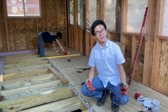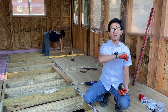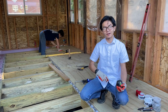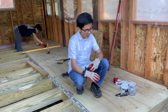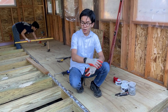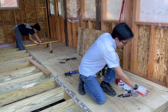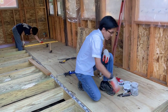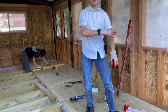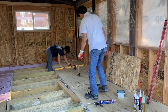Usually when you're installing things like furniture or something similar, you want to cover everything, all the corners, with screws. We're not going to do it here, because when we install screws here, we want to make sure that the plywood doesn't warp. And if we put them in the corners first, there's a great chance of that happening. So we're going to do each line in sequence. We're not going to do all 4 corners, similar to how we installed the walls. All right, let's get to it.